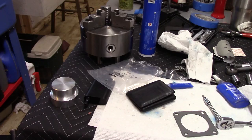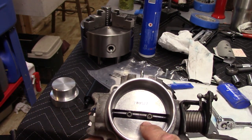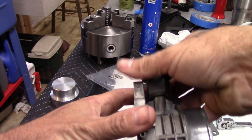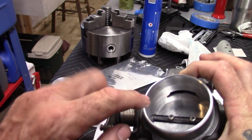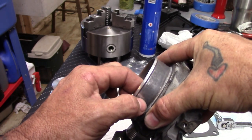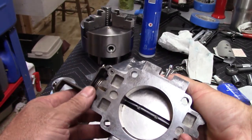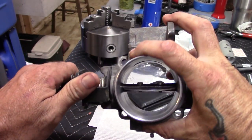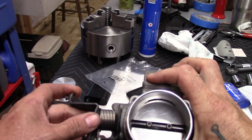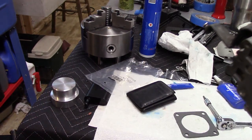All right, now I'm going to put it on the Jeep. All right, one more thing, and then I promise I'm putting it on the Jeep. The next one I do, or maybe do it to this one if we can get the bolts back out after Loctite, but could take it bigger all the way through the bore. Now that I've studied it, once I got it out, see this adjustment here? You could lay that butterfly on down flat and probably take it on out to about, shoot, there ain't no tellings, man, until you run out of metal right here. That'd be the stopping point with it, but it's thick right here. We could go all the way through there with it. We may try that. We'll see how this does, but this is pretty big. This is a lot bigger than it was. And without having a stroker motor, I don't want to make it bog, so we'll try this. Maybe I'll get another one out of the junkyard and we'll bore it out completely and lay the butterfly down some more to get a bigger bore, because it's in about a 45 degree angle right there. All right, now, promise, putting it on the Jeep.